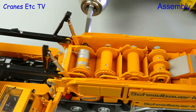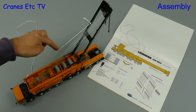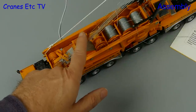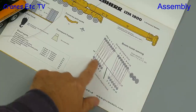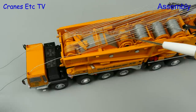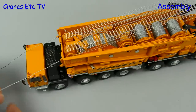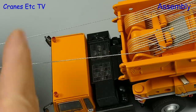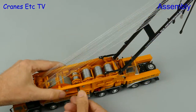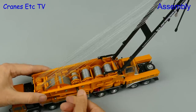Loading the first three drums is straightforward but there's a lot more work to do for the boom gantry. The gantry has to be reaved up with two separate ropes, each going to one half of winch drum number four. The approach is to reave both halves first without attaching them to the winch drums, and after tying off to the rocking equaliser we end up with two lengths of rope threaded through the winch drum. We need to maintain the same tension in both halves and make our knots at exactly the same point in each rope, then pull the knots through to the drums and start winding in, keeping an eye on the winch drums to ensure the rope is wound on evenly.